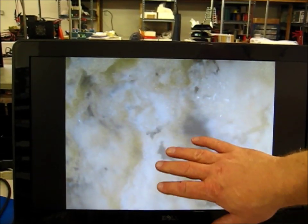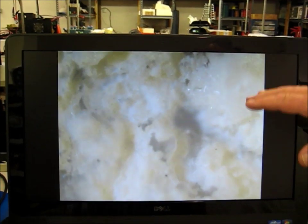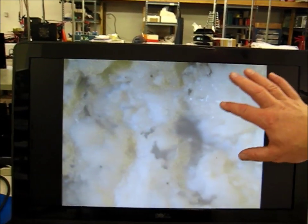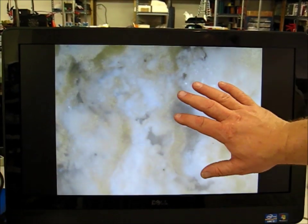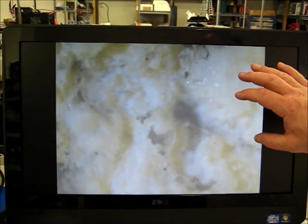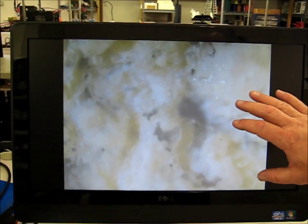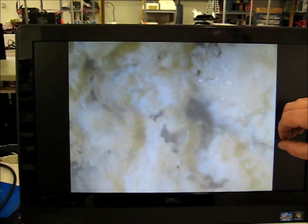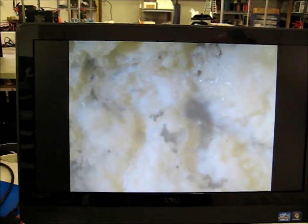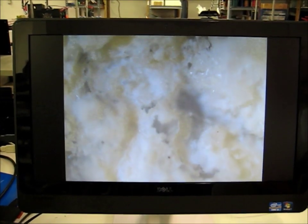Yeah, it'll switch, and you won't see this. It'll just be basically the grayish crystal. It'll look like this with the water on top. And then as you discharge it, it starts pulling it back in, and you'll notice that the crystals retain the water. They pull it back in. They pull the sulfuric acid back into it, and that's what we wanted to show you. Yeah, we will give you the mixture that we used in this.